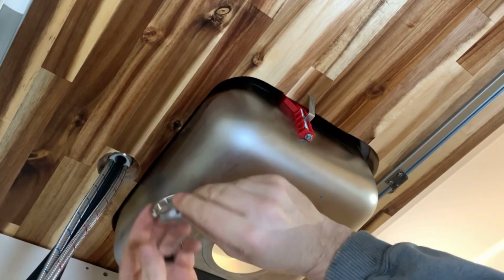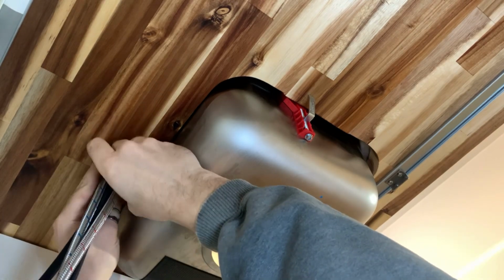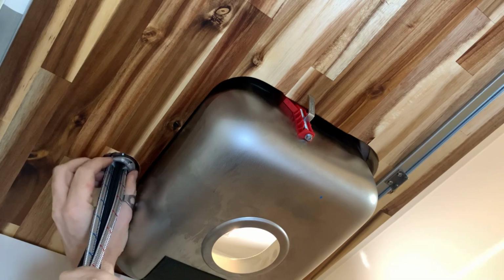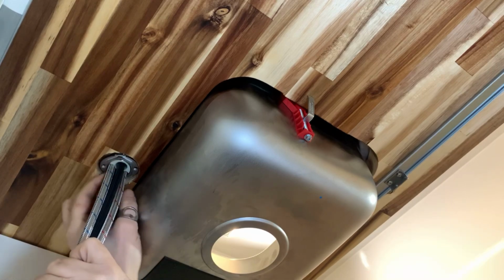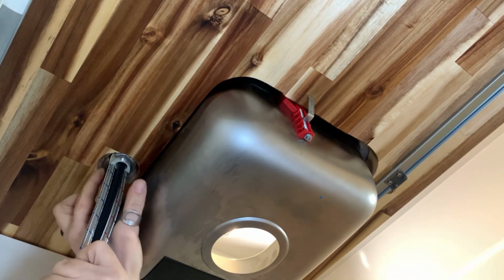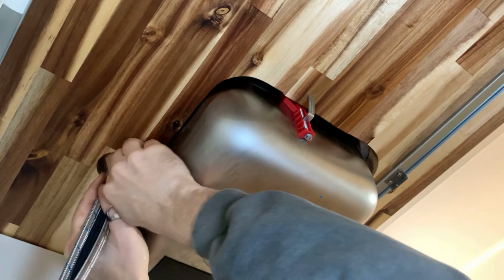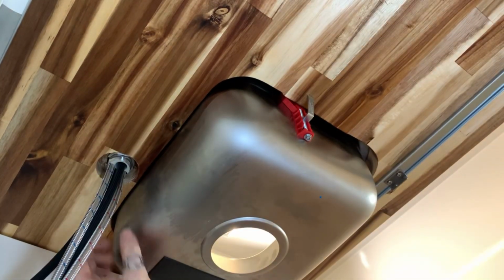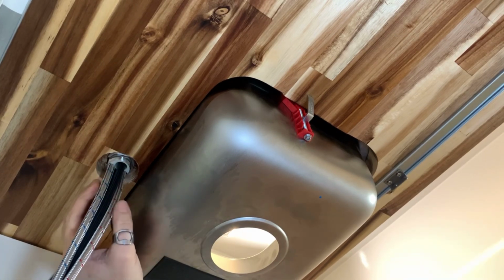With the sink held in place, now we can move on to the nut that holds the tap in place. This has a slit in the side of it, so you don't have to slide it all the way up over all the hoses. And now you see my reason for the second cut. With that started, we can spin that up. I've got to make sure the tap's in the right place, but with the tap in the right place, I can tighten that down, and then there are some screw holes there that I can put a couple of screws into so that it can't back off.